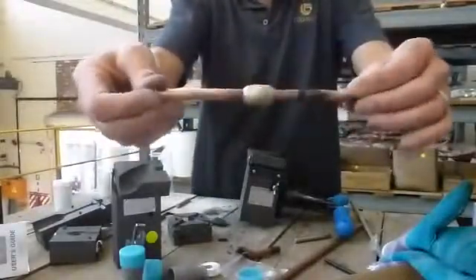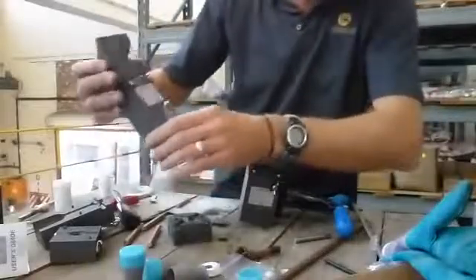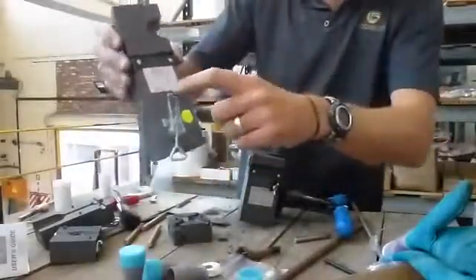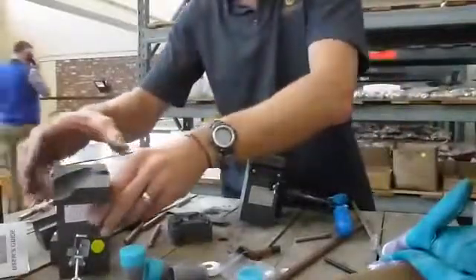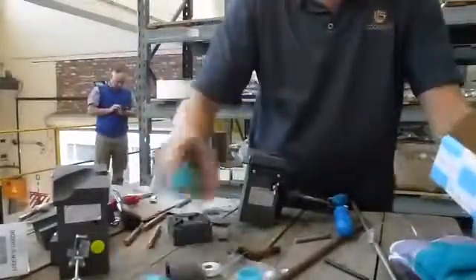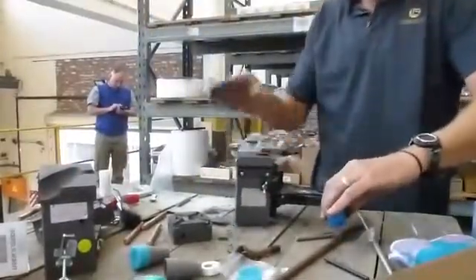This is the most common, but you get lots of other ones. Each mold specifies the weld metal size — this one says CU 150. So when you get a box of weld metal, make sure the weld metal size is right for the mold. Here's the weld metal, and here's your mold — this one's still warm from the last burn.